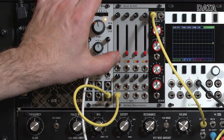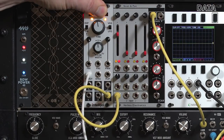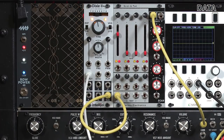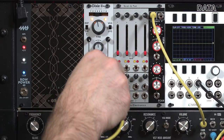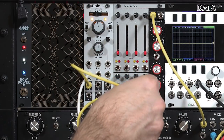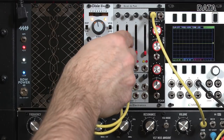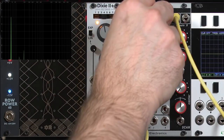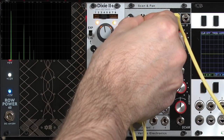As you turn the volume control and turn on the synth, come down in pitch — there's a nice really low pitch here on the subharmonic. Next up I'm going to choose the sine wave output, which will be one octave up from the subharmonic. You can see on the spectrograph there is pretty much only a fundamental here. Let's overdrive it a little bit to give it more of an edge.